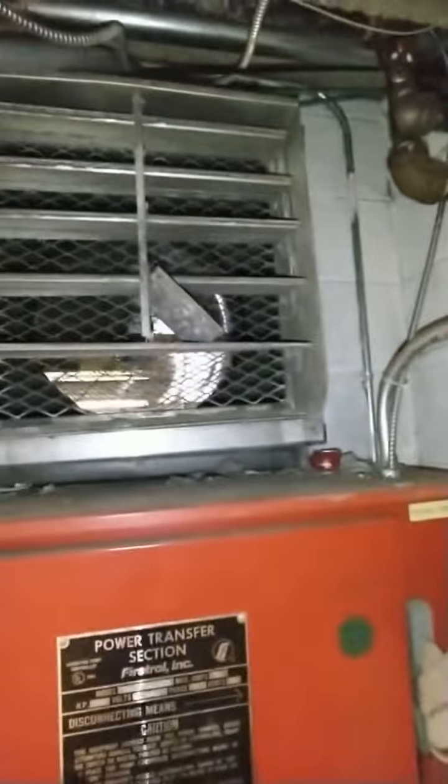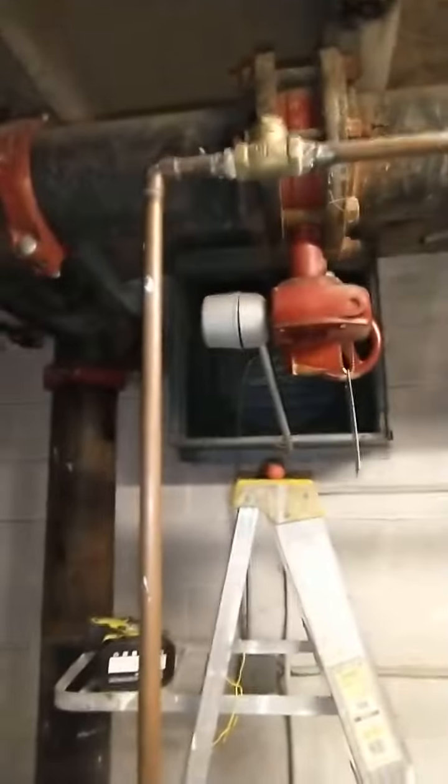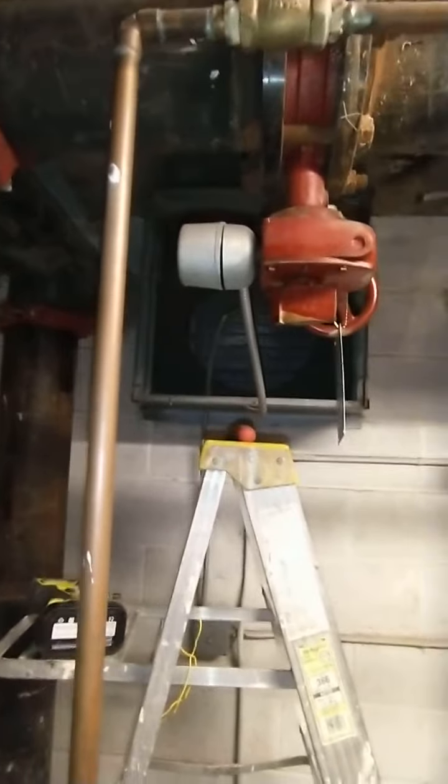And there's that fan — we're on the other side of it, going through the wall. That plate we found on the floor is going to go on there. This guy here is dead — that's the original fan that was in it. That's the new fan. I'm going to put that in there so the air will go from that room into this room, pressurize, and then push out that way and open those slats there.